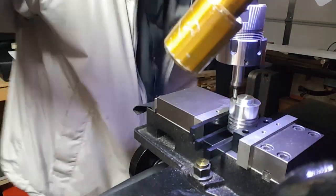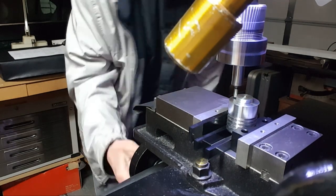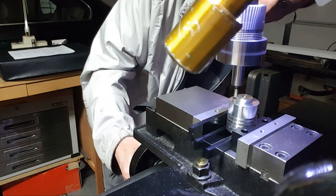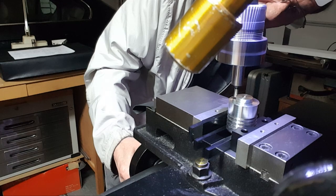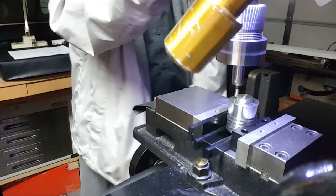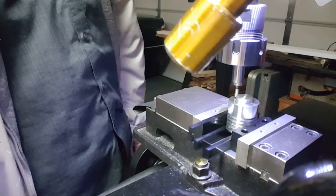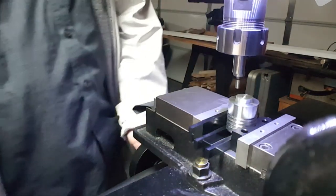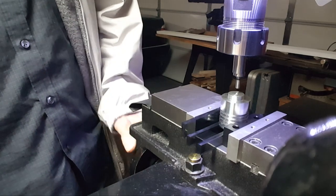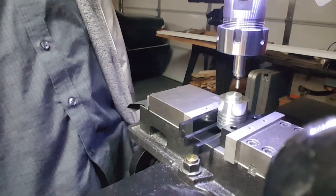Alright, take him down. Some speed. I'm not sure which way this thing's going to trip, so I just keep moving around. Hopefully I catch it. Nothing yet. There it is. Okay, y-axis, cut it in half, close it, come up, 300, 200, 100, 12, 210, I'm on center, okay.